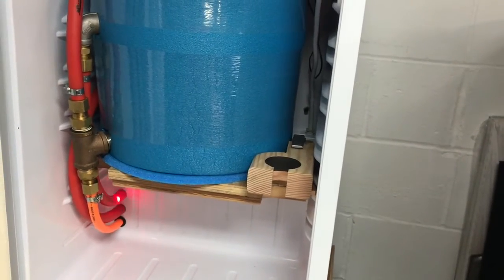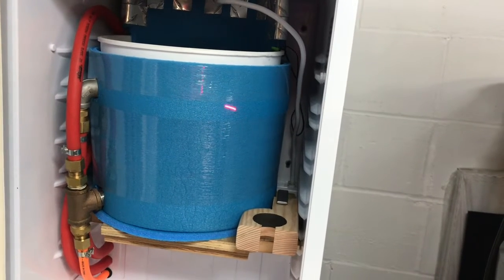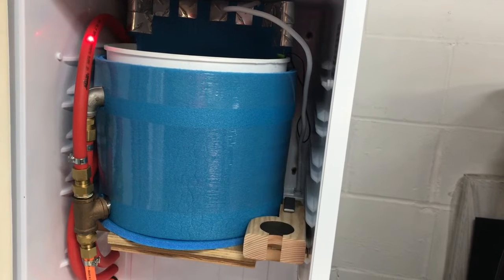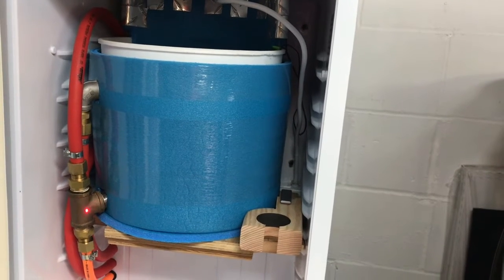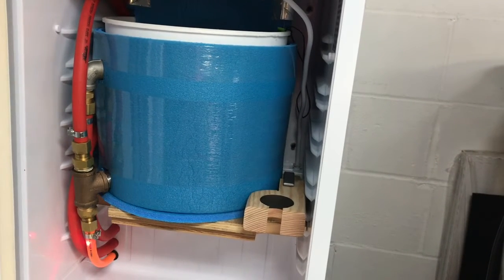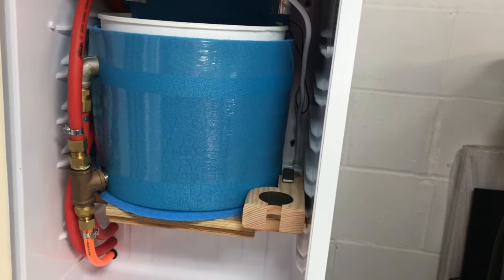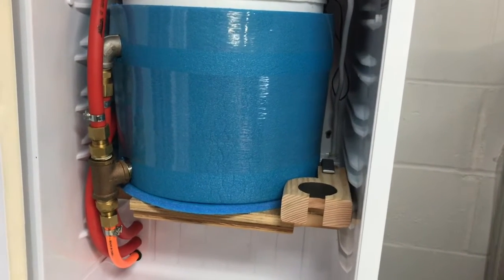The rest of it is all air plumbing. I found a spot where I could drill through the refrigerator — air comes in through a hose, then goes up into an elbow, which goes into a 20-foot copper coil inside the bucket. It comes out into a T at the bottom, and the dry cold air loops back out. Water condenses in that coil as the temperature drops below the dew point and collects down this orange hose, which deadheads into a pneumatic water separator that provides an auto drain.